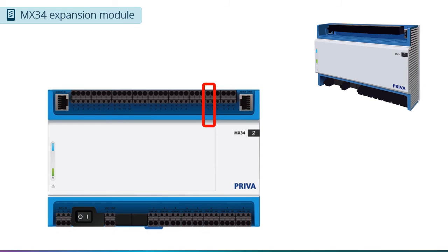First, there is no reserved analog output for the alarm buzzer. This means that you are free to use all 6 of the analog outputs for field wiring. Also, there are no alarm outputs, no RS-485 communication ports, and no Ethernet ports. What it does have are 8 digital outputs, 8 universal inputs, 12 digital inputs, and 6 analog outputs. As you can see, this module gives you a nice mixture of inputs and outputs that you can use.